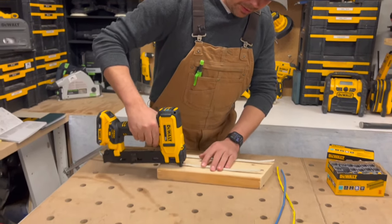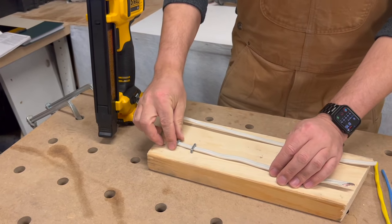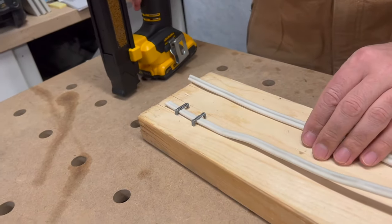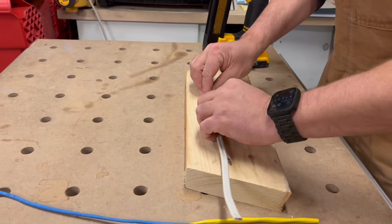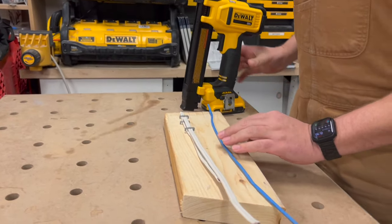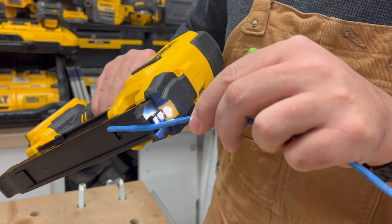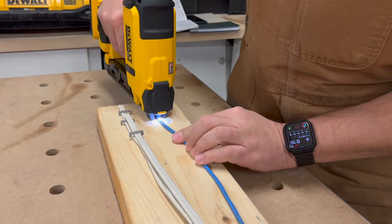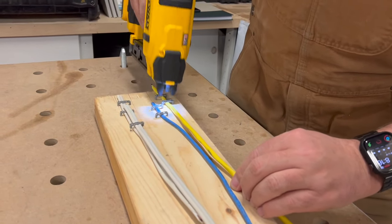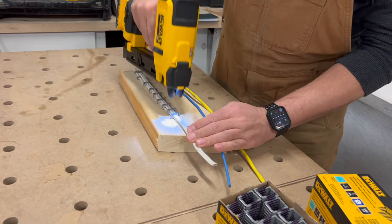Let's fire some staples. You can see the light just went on there — we press it down. Piece of cake. It does leave a little gap so you can still move the wire; it's not pinching it down super tight. Now if I wanted to do two wires, just stack them up — and there you go, just like that. If you wanted to do some Cat5, this is where you have to be careful because the Cat5 can slip in between here and then it won't fire. You have to press right on the center, so you just got to be a little bit more careful. We can do some speaker wire. Then I'm going to show you how fast we can go on the 14-2 — pretty fast.